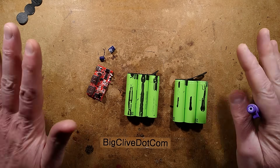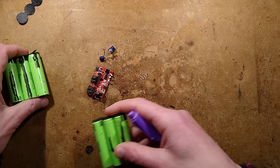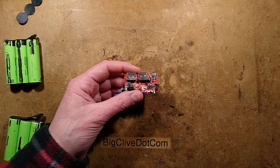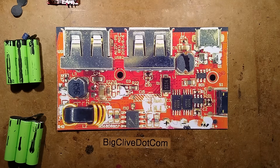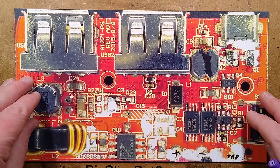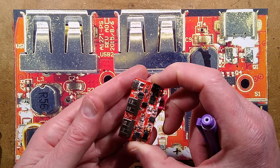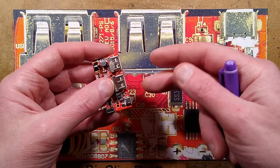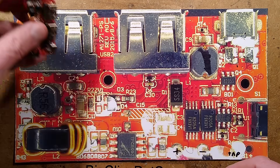I've taken the two sections of cells out — they were in series and I'll reuse these. The circuit board is ridiculously complex. I took the capacitors off so we could see underneath and removed as much of the silicone compound as possible. It's possible I accidentally reset this power bank — maybe I bridged something while getting it out. There are many ways to reset Anker power banks: holding the button in for a long time may force a reset, or some models have a hidden reset hole, or you connect a USB lead between the input and output ports and it can reboot if it's in a locked state.